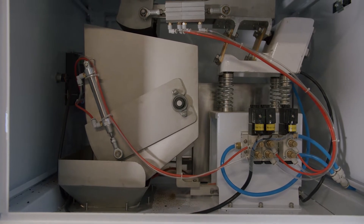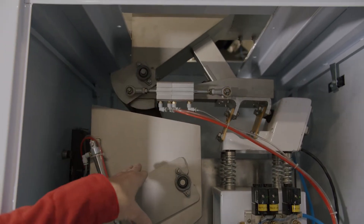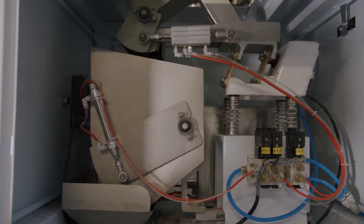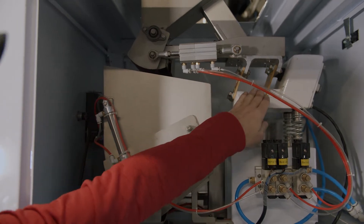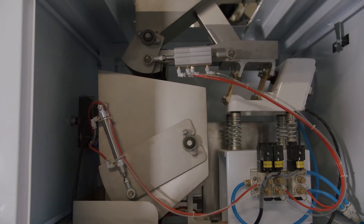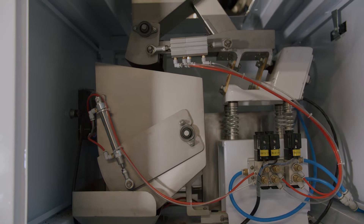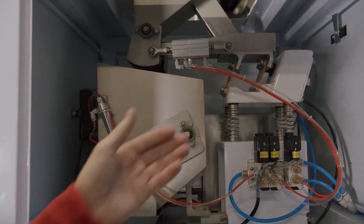Next, hit fast, and you're going to notice the gate opens all the way — it lets coffee fall directly into the chamber. This is for fast filling. With medium, your gate is half open and you can verify that your vibrator is running. Hit slow: the gate is closed but the vibrator is still running. Turn off slow and the vibrator is no longer running.